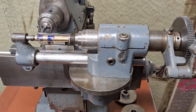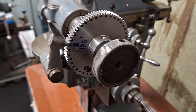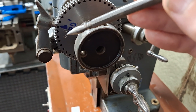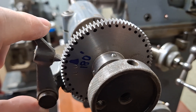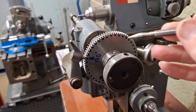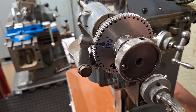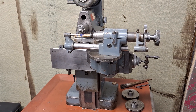This little dividing attachment that's dropped in has a tailstock support and a nice neat dividing arrangement. You may be able to make out I last did a 40-tooth gear on that - it's an 80-division gear. Nice little system: just lift that plunger out and it engages very neatly in the teeth - rock solid, really nice setup. You can probably also see I'm quite a fan of marking each division that the plunger has to go into - not a fan of ending up with half a tooth on a wheel. Right, very wobbly but hopefully gives you an idea of what the machine is, and I will get on with some machining.